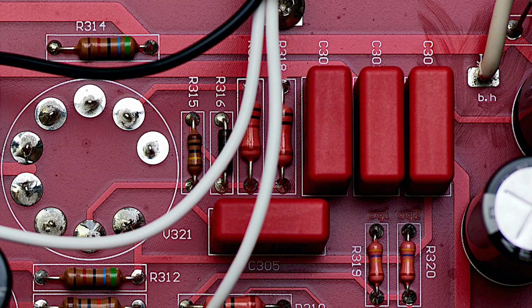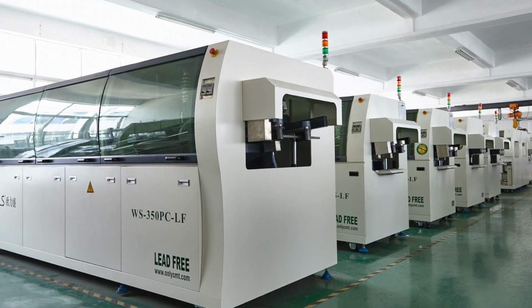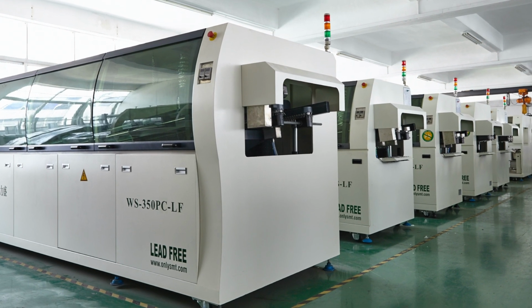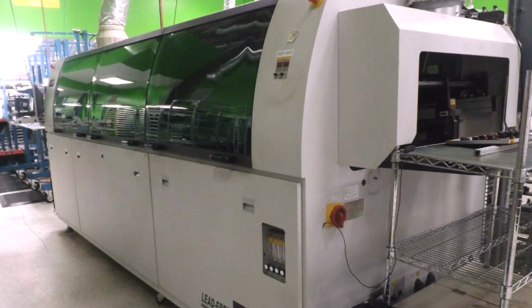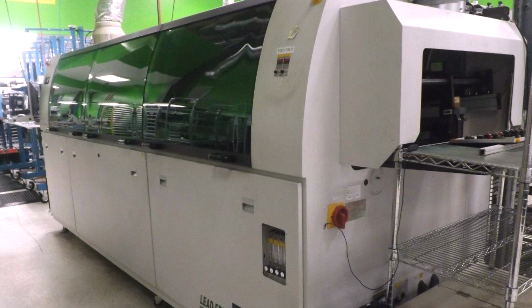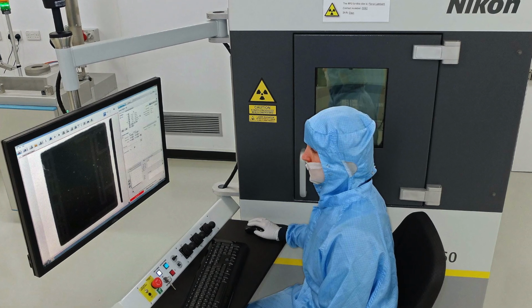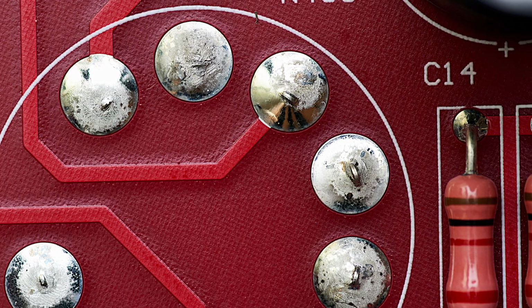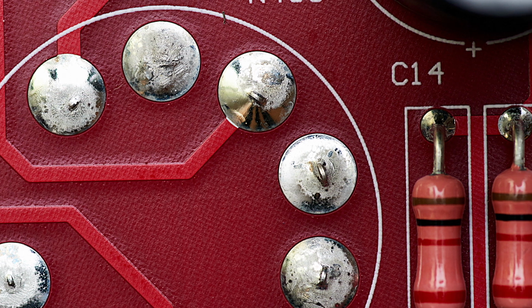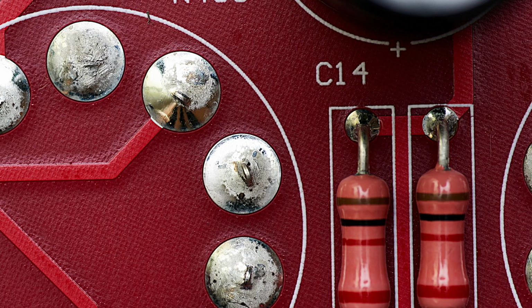And I'm going to throw some images up on the screen so that you can take a look at the soldering of these boards that we do. It is done by laser soldering systems that are extremely well controlled. The temperature, the duration, the cooling duration, and then there is an inspection system that is both done by a laser system and done by the human eye, but with 40 times magnification. There is no way that you can begin to even come close to that with hand wiring, especially hand wiring at that lower tier like what I was talking about a few moments ago.